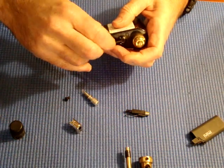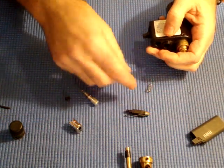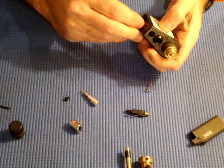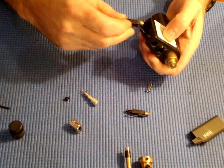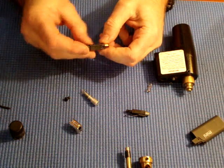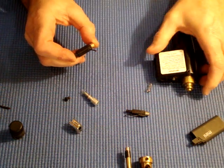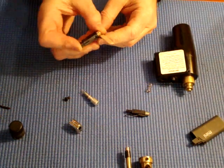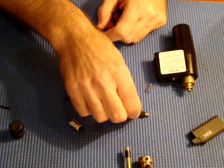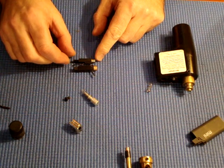Watch it — the spring here has a slit in it, and the wire protrudes a little bit above that hole. There is the original one, which doesn't spark anymore. I've tested it with a screwdriver to ground, just like that. And it just happens to be one and three-eighths inches long, which is perfect.